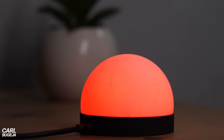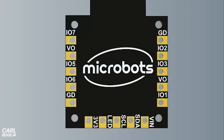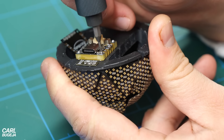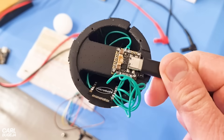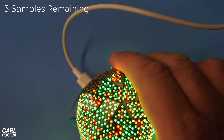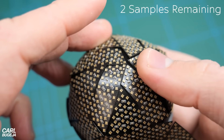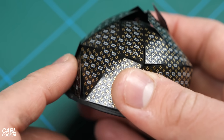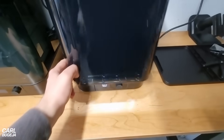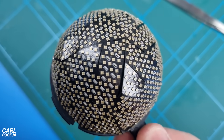While writing code to create new patterns I accidentally ripped off the flexible cable — an unfixable mistake because the tracks were in the inner layers. I modified the mechanical design to prevent this happening again, but the next board was a disaster to mount, and the same thing happened with another board after that. We noticed the tape had become less sticky over time, most probably due to temperature and humidity in my workshop. For the fourth attempt I dried out the boards before mounting them, and this made a huge difference — all the pixels curved the right way.